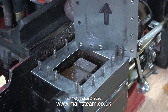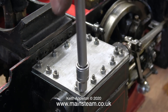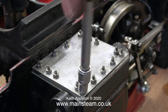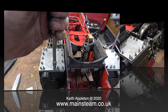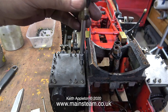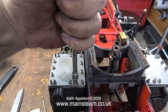With a steam chest cover gasket you don't need to take out the centre, but I always do, because after a while the centre of the gasket can sag and get caught up in the slide valve — which is not a major problem, because steam engines are not internal combustion engines, and the combination of hot water and steam blows away all the debris almost immediately. Now it's time to fit the steam chest cover at the other side. This process is absolutely identical to the one you've just seen, except it's on the other side, so I'm not showing it in great detail.